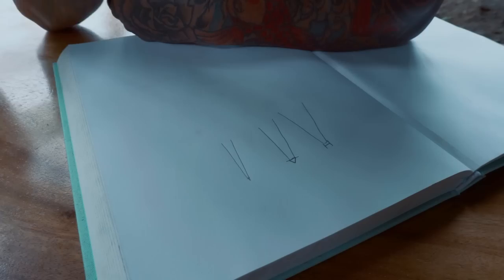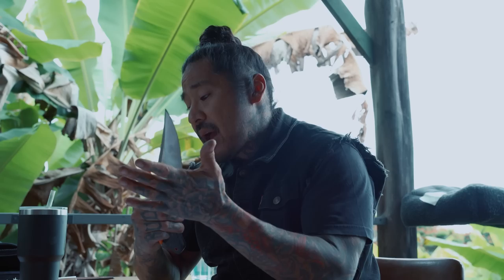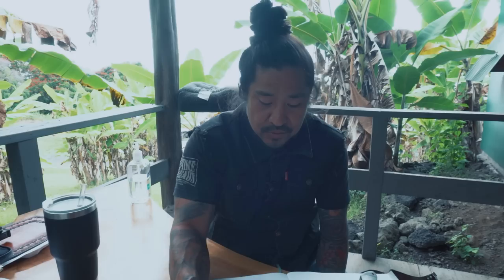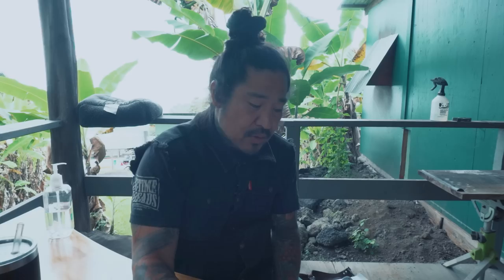What you want to do is really pull down an edge that's almost paper-thin — very fine and very refined. Then you can test it: hit it on stuff, and if it starts to react then it's too thin, so you pull that edge back, toughen it up, find the medium balance. When something is getting cut like this it easily splits apart and comes back. When you hit something blunt it has no pass-through geometry, and pass-through geometry is what we're looking for.